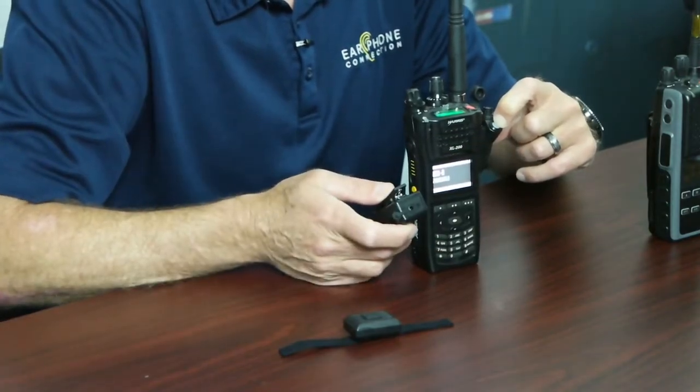I'm going to turn on the microphone and show you the process to link it. Once the microphone is on, press down on the push-to-talk button until you see the LED appear, then wait around 10 to 20 seconds for the microphone and adapter to link. You always have to press the push-to-talk button to establish that link — that's our fail-safe. If the microphone battery dies, after around 15 seconds the link disconnects and control returns to the radio.